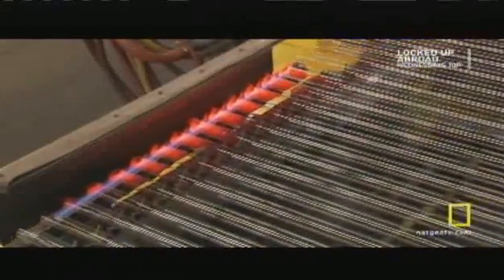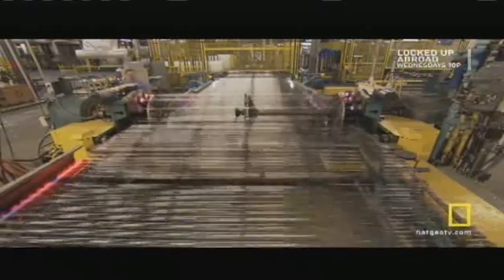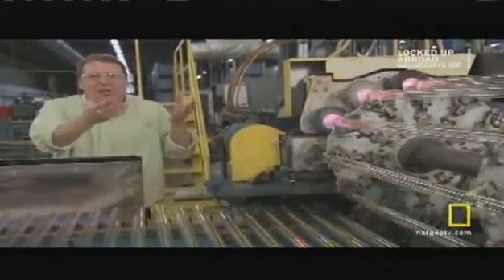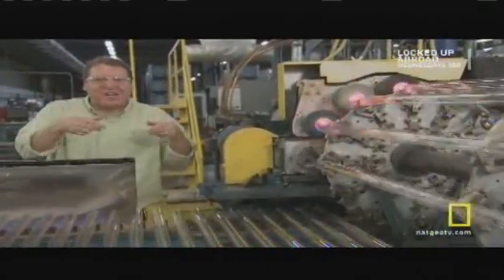Another set of flames prepares the tube's ends for the next step. This is called the end forming machine, and it does just what you'd expect — it forms the ends on the tube. This machine uses heat to round and narrow the ends of the tube to form what are known as shoulders. Once the ends are formed, the tubes are ready to become the bulbs of fluorescent lamps.